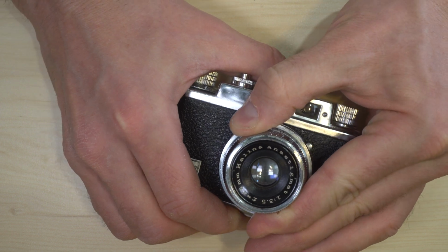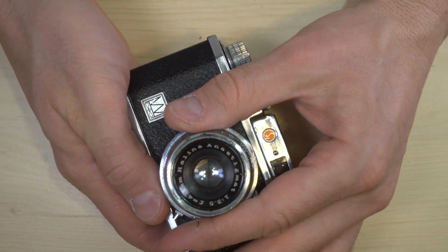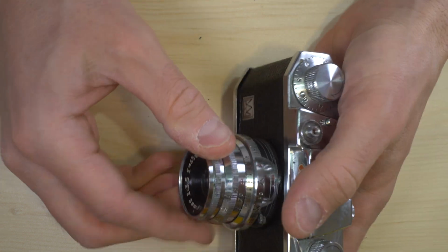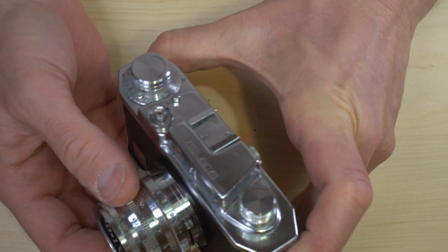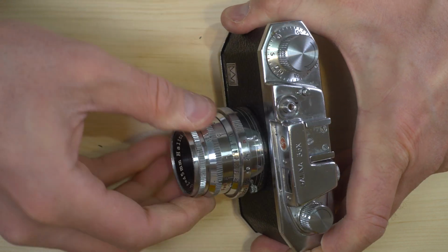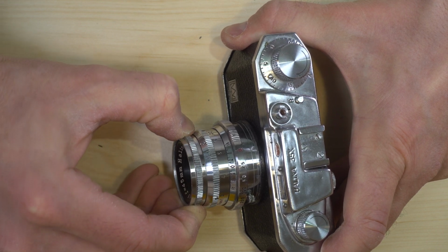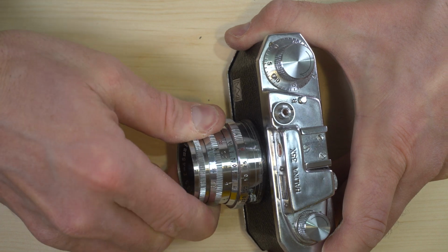The lens lubricant, oh goodness, used by Haking. In almost all of these today, unless it's been taken apart and fixed, that lubricant is very, very stiff. After a few turns, it gets a little bit easier to use as the friction heats it up and causes it to get thin. And on hot days, it's okay to use. But the lubricant on these cameras has gotten very thick with time, and it is really hard to turn the focus and aperture mechanisms on these. So I'm going to show you something that almost never happens with a camera. I just focused it to closest focus. I'm going to turn the aperture, and it is so stiff that the aperture ring is focusing the camera. So that's not the way that's supposed to work.